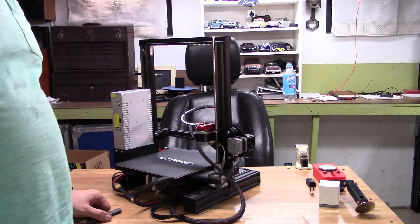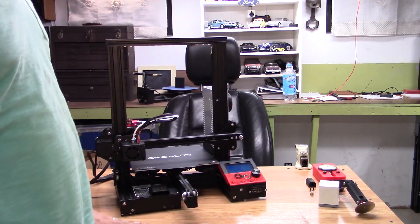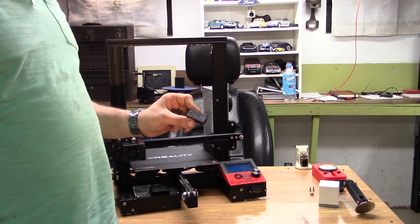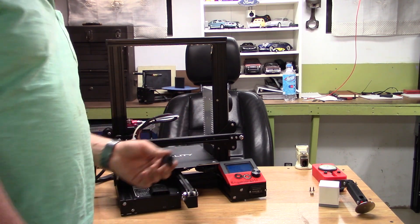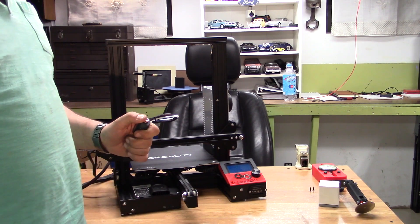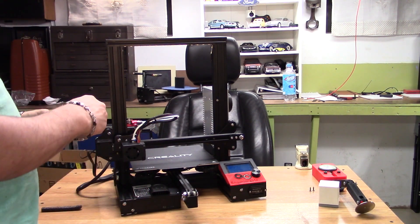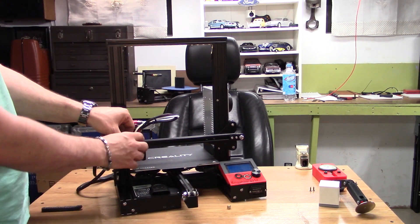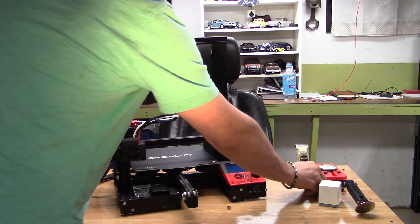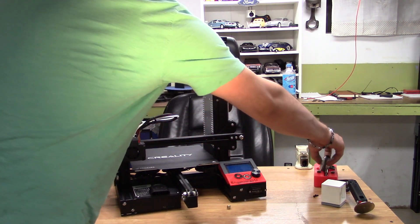One of the things I want to install now is this part I just 3D printed. It's a very small piece with a couple of holes in the back that I've already chamfered, and a hole in the front. This is for a quarter-20 threaded insert that will get pressed into this piece, and this piece will get bolted to the top of the fan cage here. I will drill a couple of holes, chamfer them, and use a couple of wood screws to fasten it.